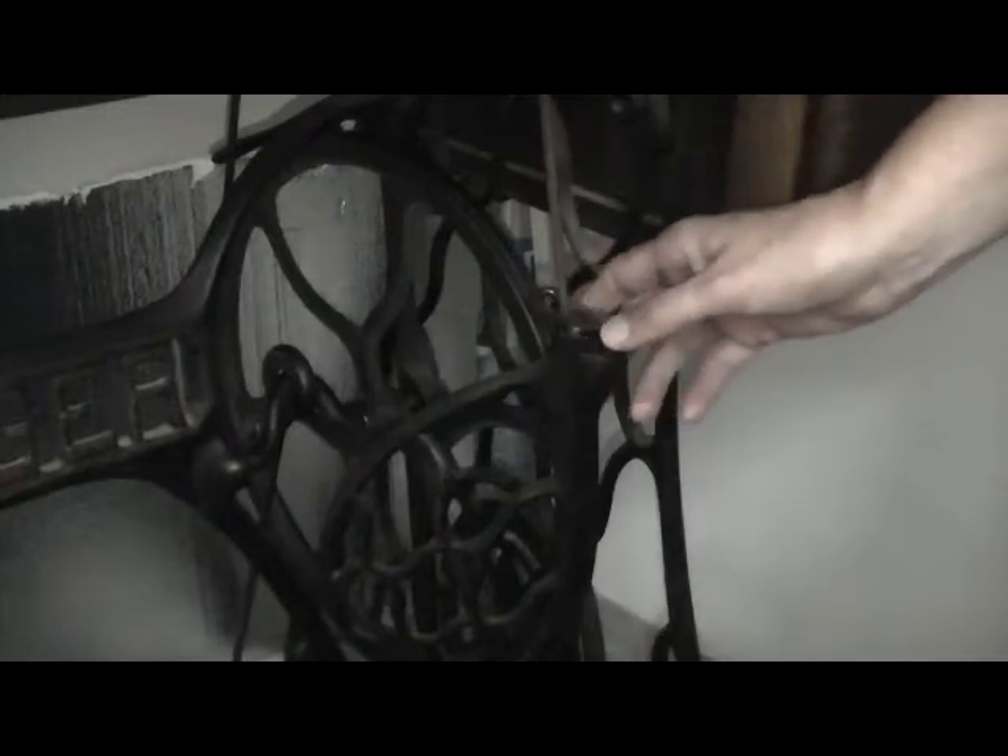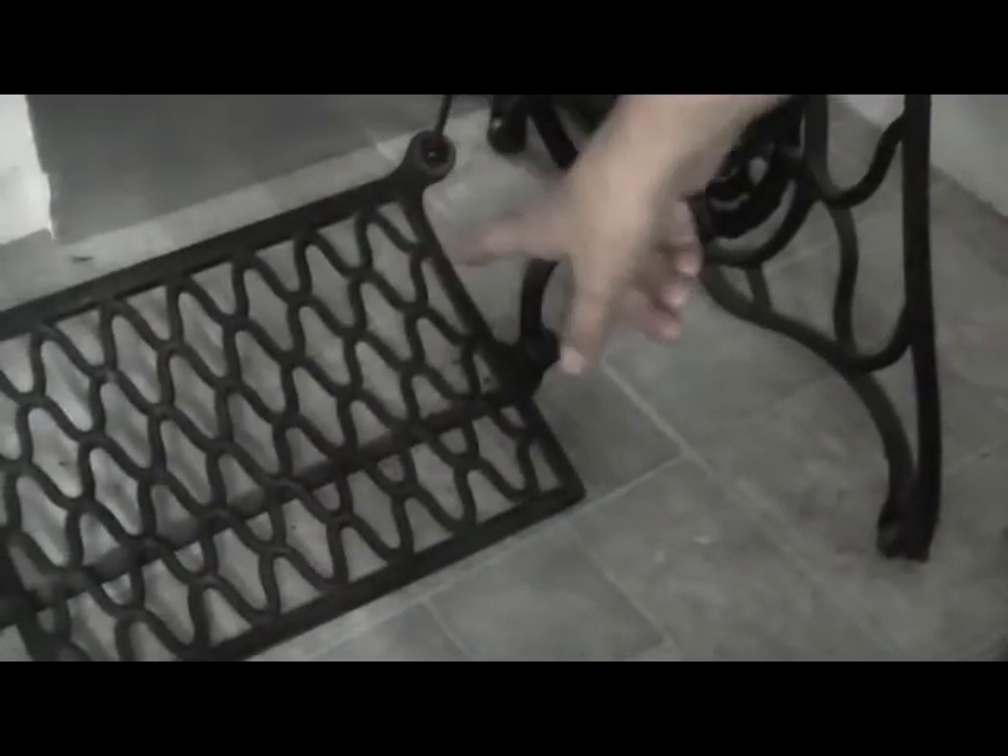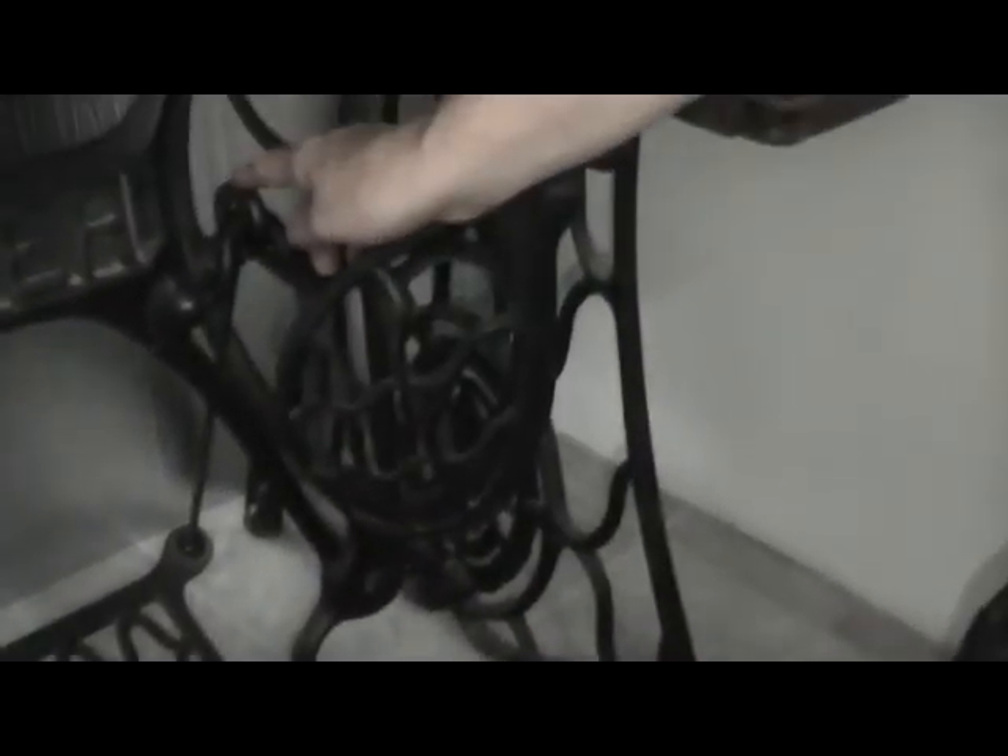The treadle — where the machine actually gets its name from — is the pedal where you put your feet. This is joined to the band wheel by a little metal rod going up the back, finishing at the pitman arm. That's the little gizmo that helps transfer the up and down of the pedal into the circular motion for the band wheel. It's a strange name for a gadget, but the pitman arm isn't unique to treadle machines or sewing machines — it gets used in any situation where you need a straight movement converted to a circular one or vice versa. Take the steering mechanism in trucks and cars — they use a pitman arm. Who knew? Apart from engineers and mechanics of course.